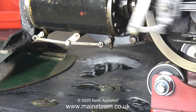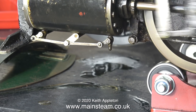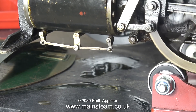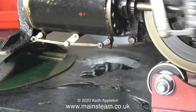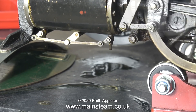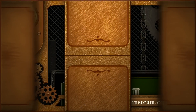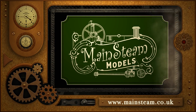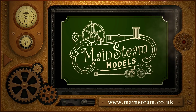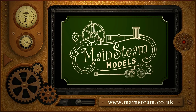It's running a bit jerkily because I've got it notched up one notch on the reverser. When I pull the reversing lever fully into reverse everything evens out. The amount of oil is dwindling and it's much dirtier than when we started. This was a simple job that could have been made a whole lot worse had the twist drill broken off in the drain cock. Thanks for watching — please visit my mainsteam models website, click on the video playlists section, and you'll find other videos you may like to watch.